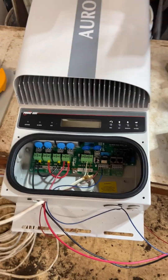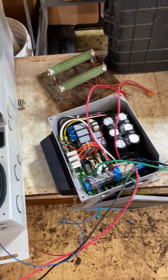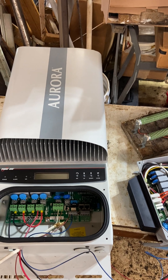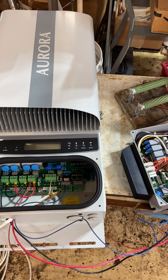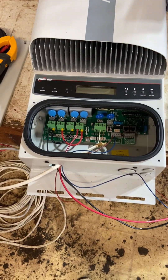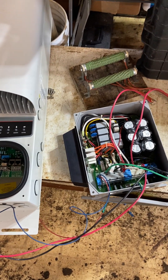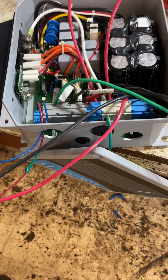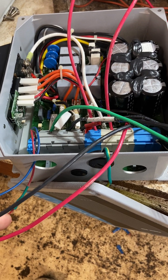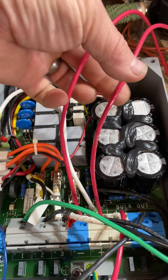This power is going to grid — I'm not doing a battery bank, so this will be mounted on the outside shed wall. Three-phase AC comes down to a disconnect, then to the interface box, then via PVC over to the inverter, then the inverter to a grid disconnect, and onward into the grid. All these have to have conduit-type fittings, which I haven't gotten yet. It'll most likely all be 10-gauge, with 8-gauge for the heavier loads.